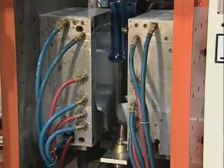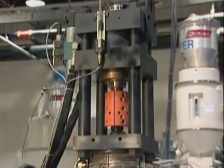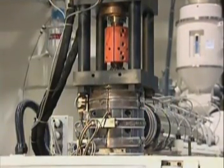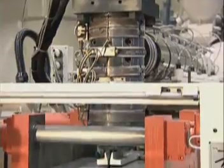A key technology difference between other water bottle machinery and GMG's is the plasticizing unit. GMG uses a flow-through die head in conjunction with a 24-to-1 LD reciprocating screw unit, resulting in the production of high-clarity polycarbonate water bottles.